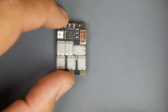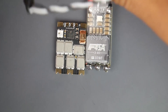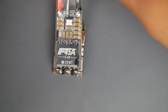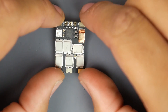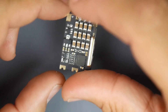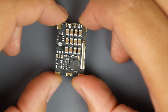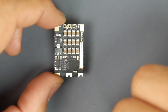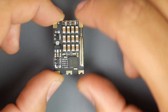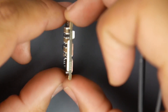Another thing that's really interesting is the size — it's not as big as you might think. It's actually slightly smaller, just a little bit wider than most ESCs. To have all this in one package in this size is just absolutely remarkable. Filtration looks somewhat minimal, and again this is using an F3 microcontroller unit, which means we can get away with using less capacitors. We have 12 ceramic capacitors on the back, the F3 microcontroller unit, the voltage regulator, and other circuits.